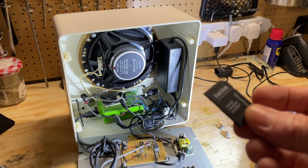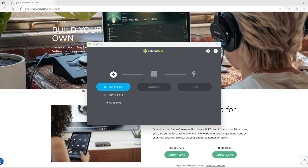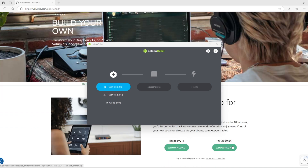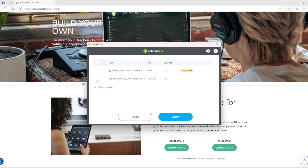I've got the SD card out, so time to go plug into my computer and reload the software. Once you're at your computer, go to volumio.com and download the Raspberry Pi version of the operating system. Once you have that downloaded, get your SD card formatted in the FAT32 file system. You need at least an 8GB SD card for this. And then you need an imaging program like Balena Etcher, which is what's shown here. Raspberry Pi Imager also works. In this case I'm using Balena Etcher — you point the program at the image file that you downloaded from volumio.com and then select the SD card.